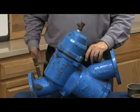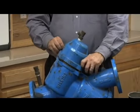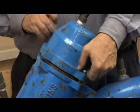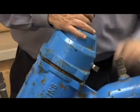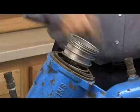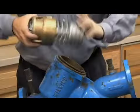So let's go ahead. Two external relief valve sensing lines, we remove those. We remove our relief valve body for the repair. I'm going to do our checks first. This being a 575, it's going to have the larger loaded spring underneath. Once I take the cover off, what I see is this. My spring stem assembly comes out in one piece, just like this.